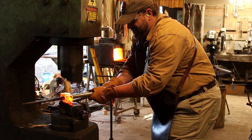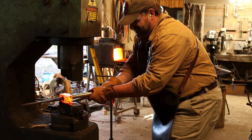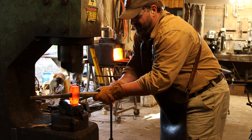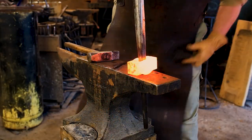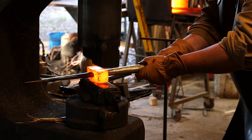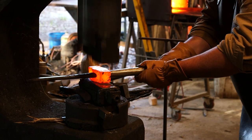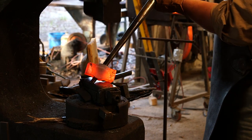For the most part, the drift acts as an internal anvil. Even though I'm bumping it down and keeping it tall, making sure there's no gaps, the drift is really a type of anvil that allows you to hammer the piece and bring the cheeks in. On the power hammer you can see there's a combination die — a rounded side and a flat side. In an operation like this that's where it really shines: I can go to the rounded side to draw the cheeks, then slide back to the flat side to keep everything nice, straight, and neat.